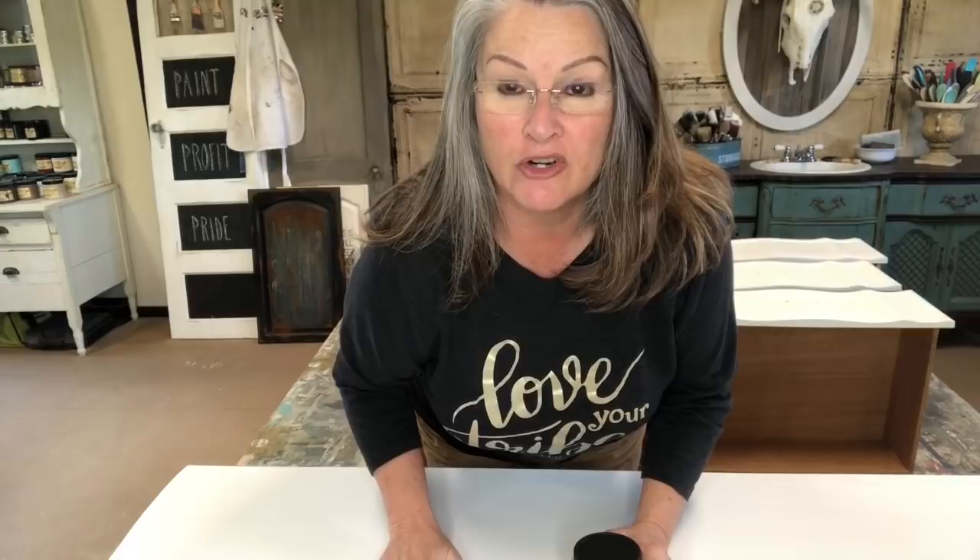After the first coat, allow it to dry two to three hours. I did a second coat and let it dry another two hours. You want to let it set overnight — 24 hours — to really cure and harden. Then come back and do the scratch test: scratch the surface with your nail or something hard and see if it comes off. That tells you you've got a great bonding primer on that slick surface, and that your paint is going to bond to it. Now your piece is ready for paint.